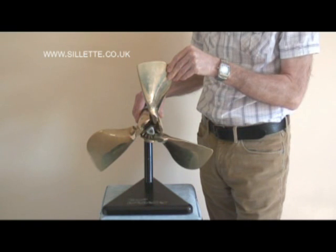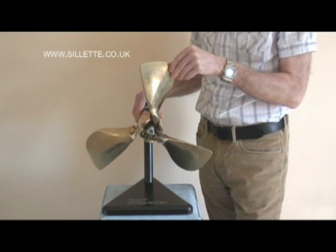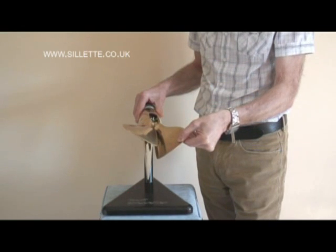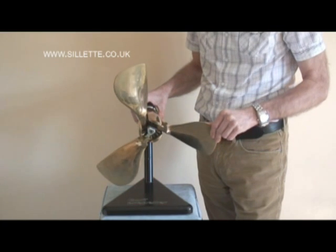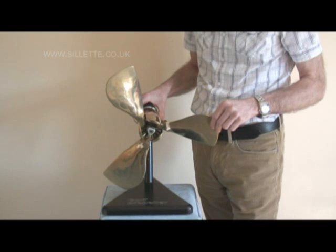When manoeuvring in close quarters or reversing from a dock, the propeller will almost always be in overdrive. But if the standard pitch is required, simply again select neutral, allow the propeller to fold, reselect ahead, and it will always open in the lower pitch setting.